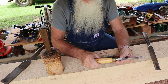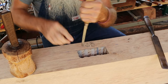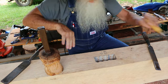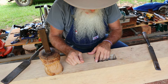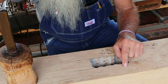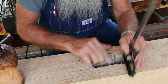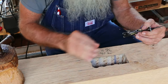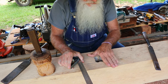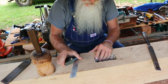I have a little small corner chisel that I can use just to get started. Then I can come back with my inch chisel and start working all this corner out, slowly working my way back to the scored line, checking with my combination square to see how square I am coming straight down. I want to keep the insides as square off the top as I possibly can, because that ensures a tighter fit when the tenon goes in — I want my post to be pretty secure and not wobbling around.